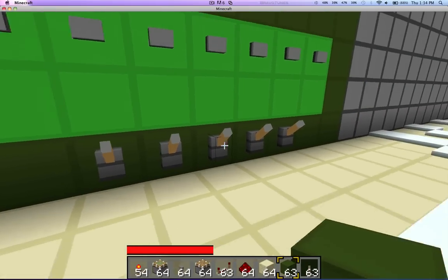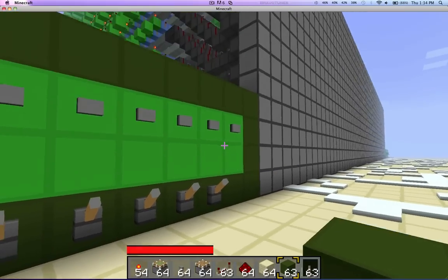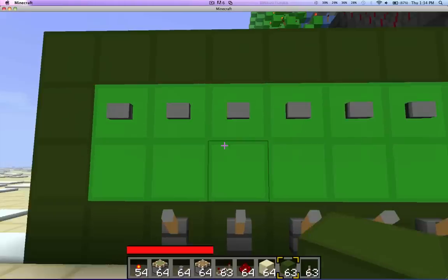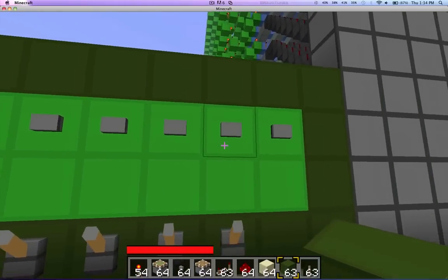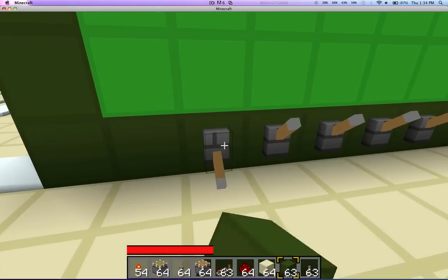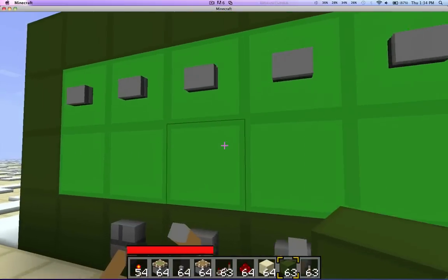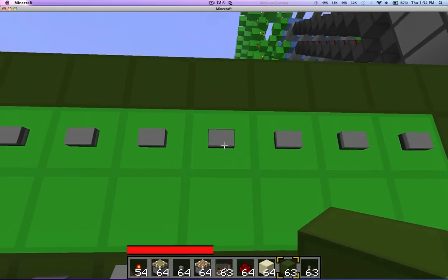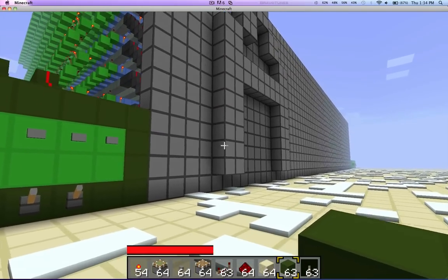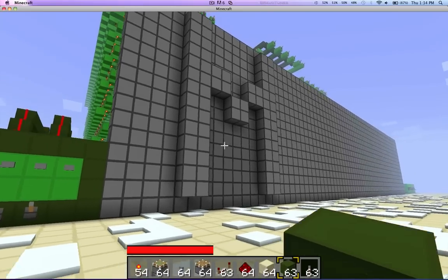Basically, along the bottom here, we have the selection of which display you want to program. So, first letter, second, third, fourth, fifth, and so on. And we've got six buttons to program it with and then a reset button. So let's try the first letter. If we hit that, and then we have to go on, and then one, two, four, and eight. So letters will start to pop up, and it'll switch to an M in a second. And there we go, M.